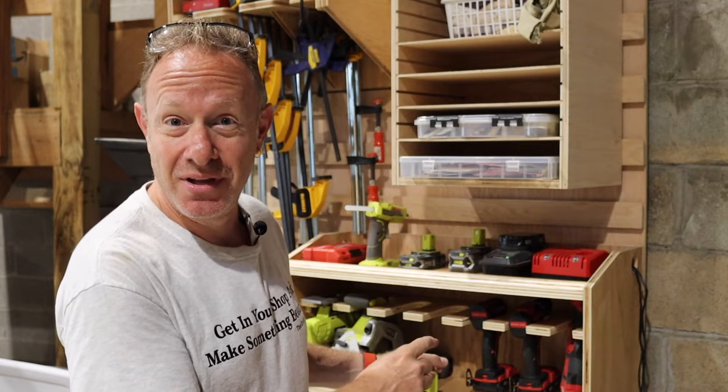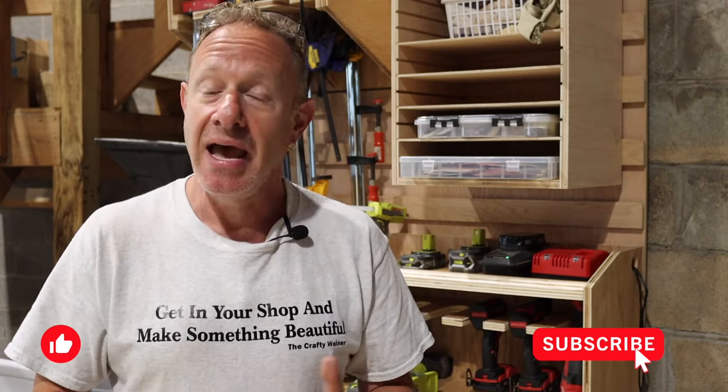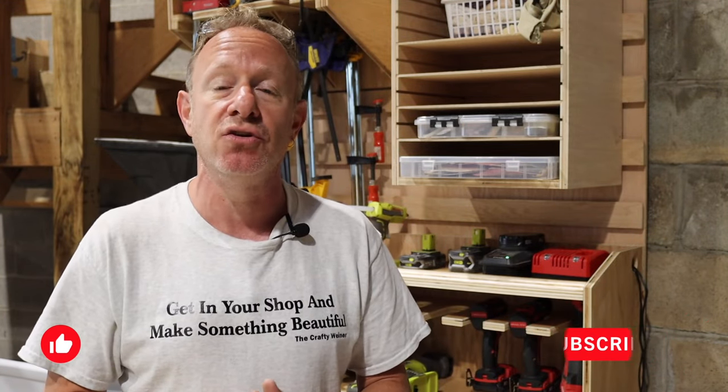When I was done it was time to hang this beautiful cabinet on the wall. This was a great project — super simple to build. It only takes one sheet of three-quarter-inch plywood, a quarter sheet of eighth-inch ply, and some polyurethane. You can use deck screws, pocket holes, or glue and brad nails — however you want to put it together. The beauty of it is it hangs on the French cleat wall so we can put it anywhere, which is also a teaser for a future project where we'll make it mobile. Thank you so much for watching — make sure you like, subscribe, share, and hit the notification bell so you know when new videos come out. Keep building beautiful things!